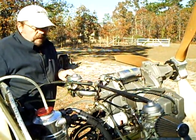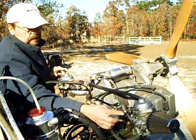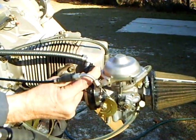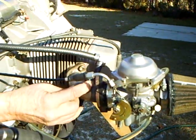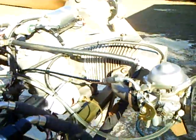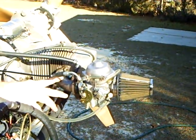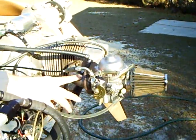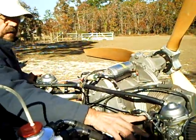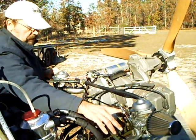In normal operation it seems like this is going to work out okay. On this setup we didn't have any provision to secure the carb. Normally, on these intakes as delivered today, there's a bracket and a spring that adds a little bit of security to the carburetor installation. There are actually some models where they hook underneath the clamp to secure the carburetor. In normal operation, ejection of a carburetor shouldn't occur — but the safety devices should still be on there. In a bad shake after landing from bumping, I could see that you could perhaps eject the carburetor, but that would be regardless of in or out intakes.